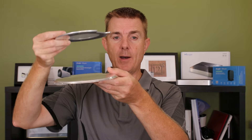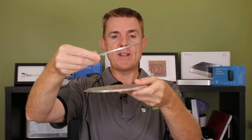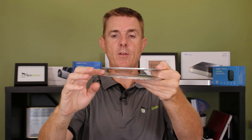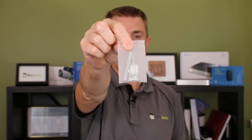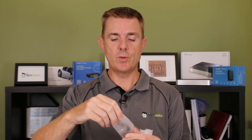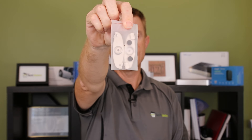If you have a false ceiling with ceiling track and ceiling tiles, then you can put this metal plate above. You get some bolts and everything that goes with it, sandwiching between the tile. Then again, you can bring your device up and mount it there. To make all of that possible, you get a packet of long bolts to go through your ceiling. If you just want to fit this to your ceiling grid, you get a couple of clips that pop over the rail and snap into place.